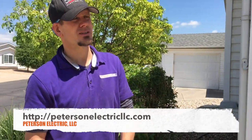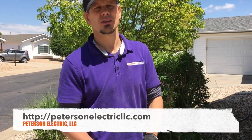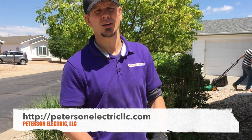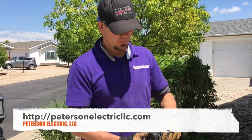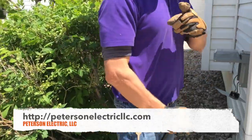Mind you, just because you plug into a 110 outlet, that circuit is most likely tied to other outlets in the house — especially if it's the front outside circuit, which is often tied to the back outlet and the basement plug. That circuit may travel through the home serving other devices. It could be off the same circuit as your freezer or refrigerator in the garage, and when you try to charge the RV you may end up popping the breaker or GFCI — and then you've lost food to spoilage.